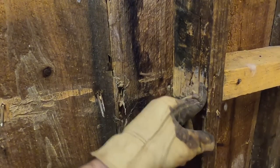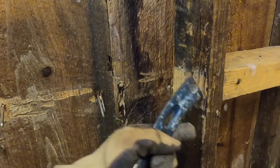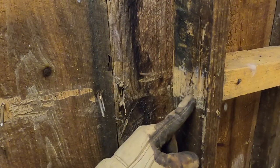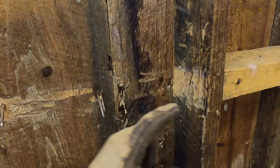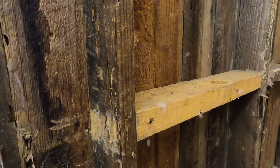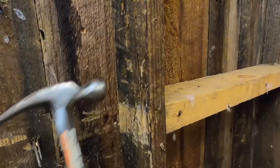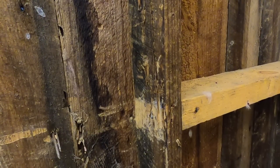I've uncovered a little more damage right here on this stud that I thought was okay. It's not the greatest stud ever, but that's pretty much sapwood. This is undoubtedly a heart pine stud and it's got a lot of solid stuff toward the middle. I'm not super worried about this stud and I'm not going to replace it, because I'm framing up a window going that direction and there's going to be a heavy-duty — probably a double stud — right here. So this one is really not that serious, and it's still fairly solid. Not perfect, but solid enough.